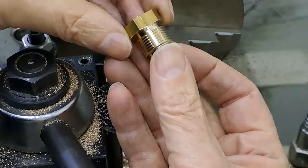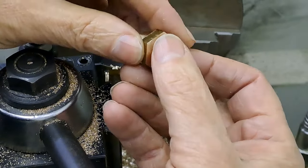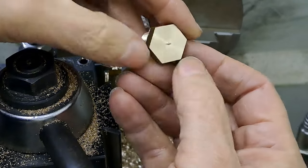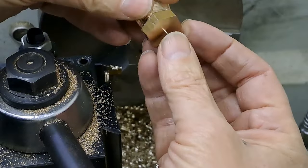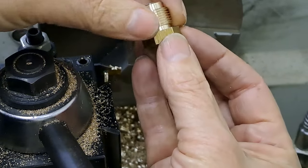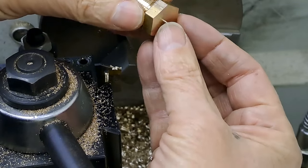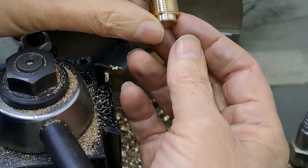That's the bolt. Just going to get this into that split bushing now. Turn that off. Straighten this edge up. Give it a quick clean up. That's actually really quite nice. And then just put a chamfer on using my turning tools just to tidy up. This edge will just need a little bit of a file. There's a few sharp burrs on there, you can probably see. And then that's that done. That's the end plug for the axle pump.